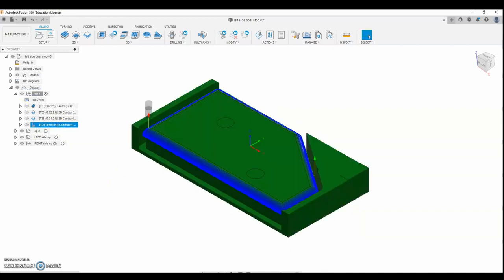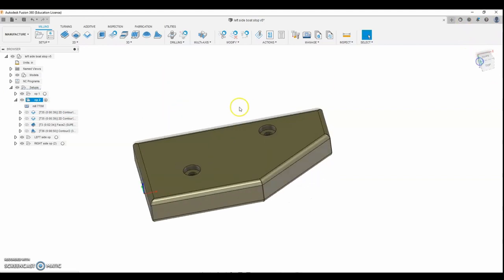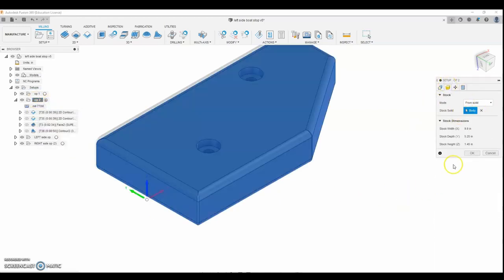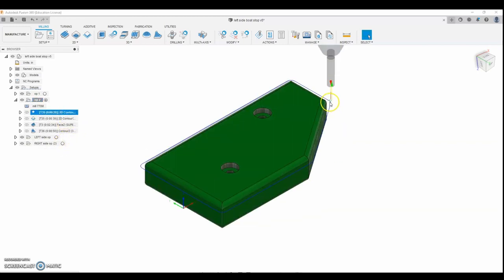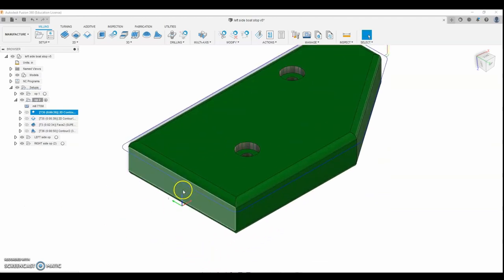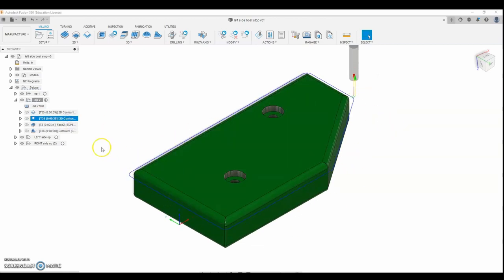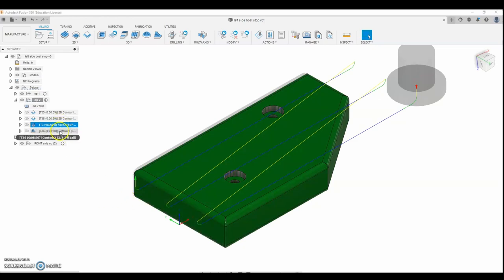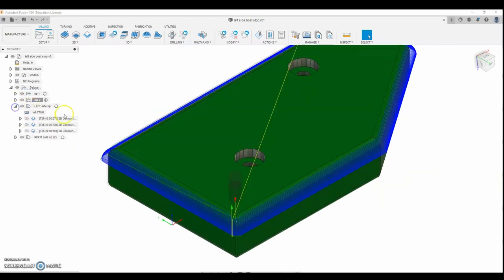For Op 2 it was really straightforward. I set stock to the solid body since I do have a top hat, though with plastic it doesn't matter much — I trimmed the top hat on this pass. I took an indicator and indicated both sides to find out how far off I was from the first stop — I was actually pretty close. The face on the second side was a lot easier since that stock was much smaller, so centering was easy and it came out really nice. The surfacing is identical to the first op — I still need to work on that toolpath.